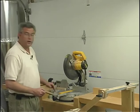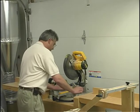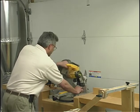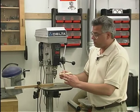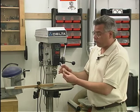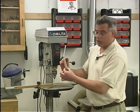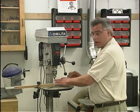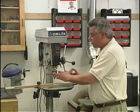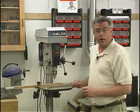It just takes a couple of seconds at the miter saw to cut each of the pieces to length. I've taken a few moments to go through and lay out the locations for our mounting screws for our pulls — they're 3 inches on center and centrally located along the pull. Then I've taken a 3/32nds inch drill bit and installed that in my chuck and set up a couple of stops so that I can make all these cuts very accurately.